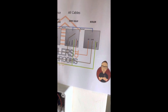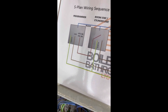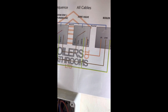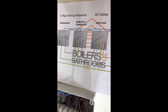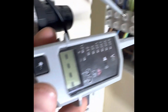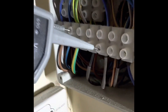So we'll pop that up and do some testing over the 10-way and see how easy it actually is to read. With the new programmer on and hot water on, we check to make sure that we're getting 240V to the 10-way from the programmer, which then goes down to the cylinder stat.